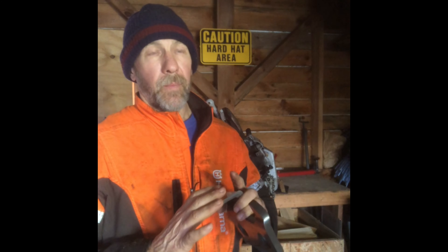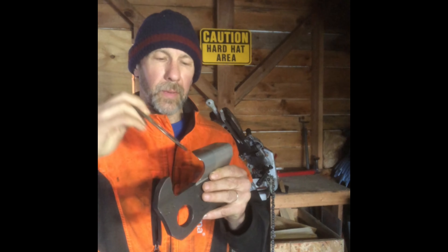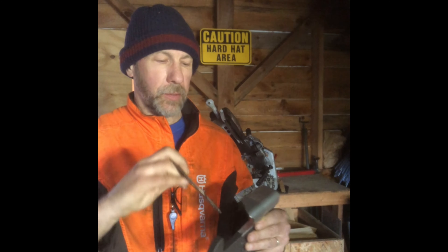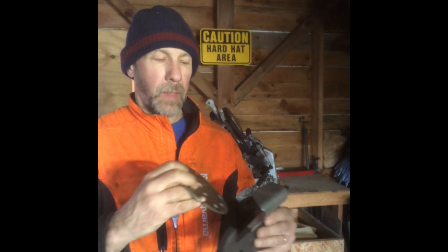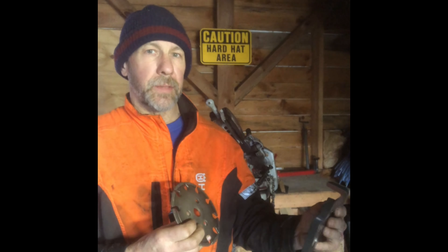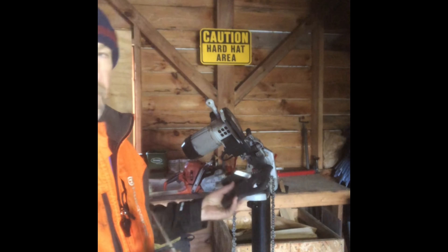Let me get started with the actual grinder. For me, I want to have a grinder where the disc is turning into the cutting edges. There are still grinders out there where on one side of your chain the stone grinds in, and then when you turn things around, the stone is coming out. Personally, I find it difficult to get consistency of sharpness from right side to left side if the disc is cutting in two different directions. So I'm using this Maxx — M-A-X-X — no affiliation whatsoever, it's just what I use. That's one thing: stone going into the tooth on both sides.